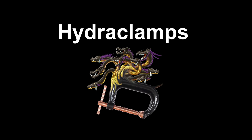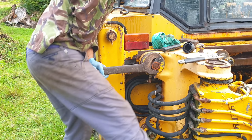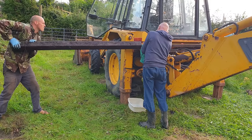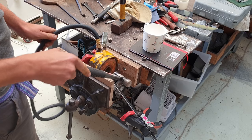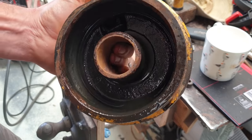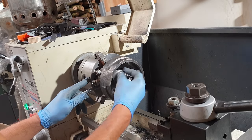One last word on hydraulics: get the seller to demonstrate the hydro clamps working. The little donut-shaped hydraulic cylinders lock the kingpin to the main frame of the digger, or release it so that you can slide the whole assembly from side to side. It's common enough for them to seize up and lock the back actor in place, and if that happens they will want new seals. The job's not too expensive or difficult, but it does take time to get the cylinders cleaned up and a very big spanner to get them off.